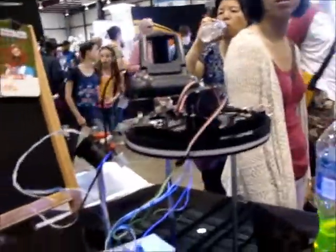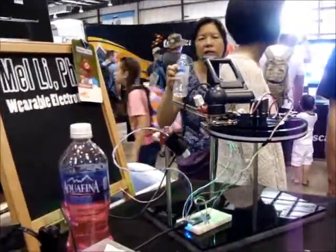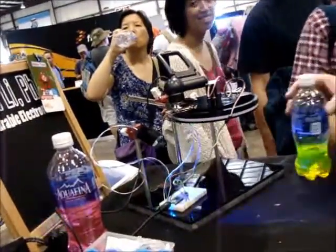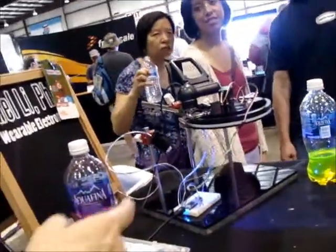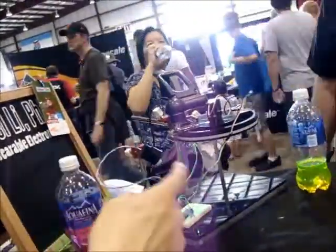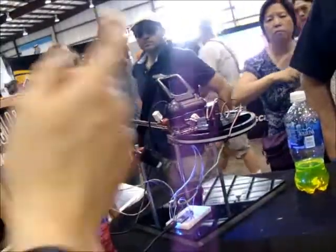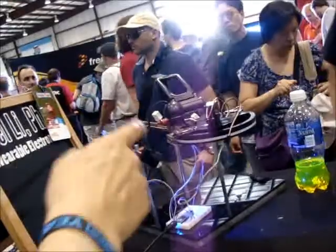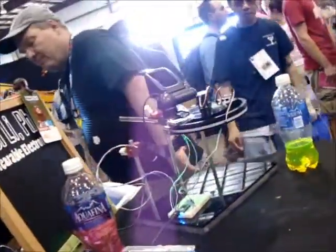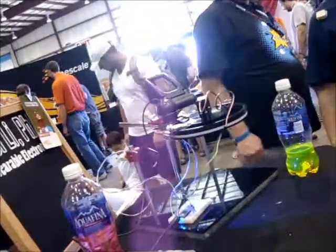What you're seeing here are the excitation lights. With fluorescence, you have an excitation source and then you measure the emission of the light. For that you need two things: an excitation light control and control of the emission filters. The filter is switching back and forth — you can see it if you look in that hole — and it's controlled by the servo on top. The Arduino and Atmel processor are controlling both the motion of the servo and the turning on and off of the lights.